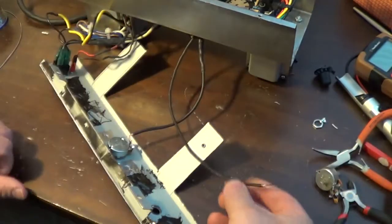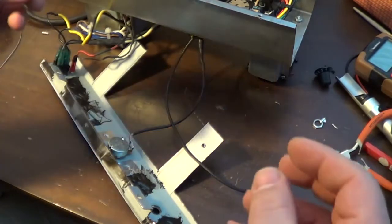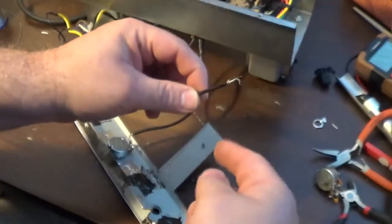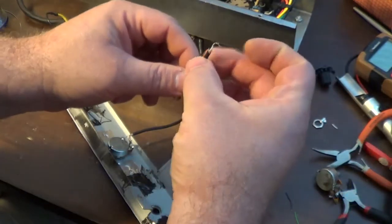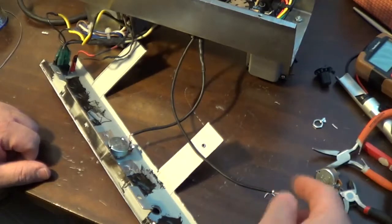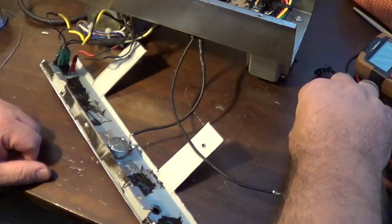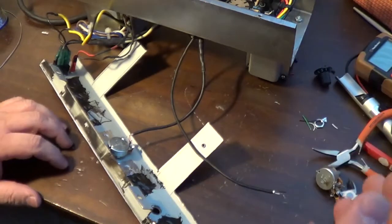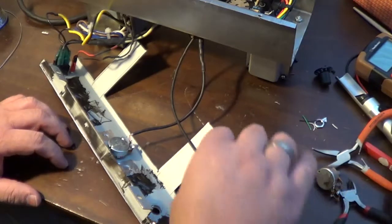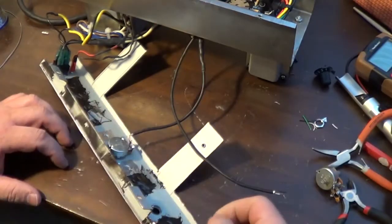The problem with that is that there will be inherent capacitance within that wire, between the shielding and the other conductors, the other leads that are in there, and it'll essentially act like a condenser microphone, which uses capacitance too. You'll have to look up a condenser mic to see what I'm talking about.